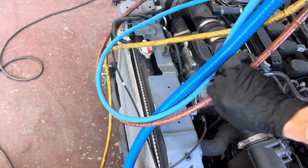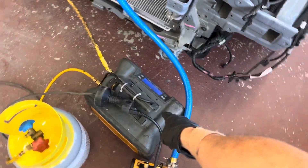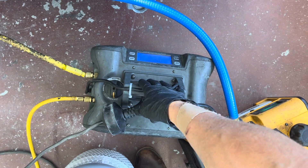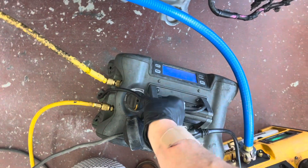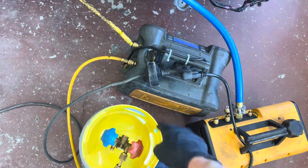So I go through the extra step of actually vacuuming out my hoses every time, making sure they're under a vacuum. You can see it's at 137 microns. I vacuum out my recovery unit and vacuum it into recovery, move around the knobs to make sure I have it all vacuumed out, put it in the purge, and purge the unit of any air in the system. That's why I'm able to get it down so low before I perform any procedures.